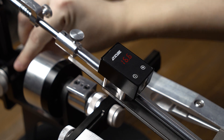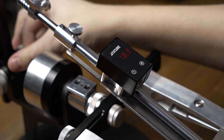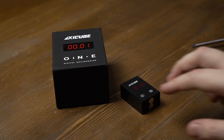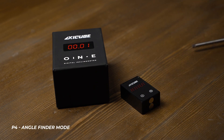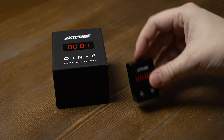After that, we put the angle finder on the stone holder, set the sharpening angle, and fix the lifting unit. Then let's switch to the angle finder operational mode — this is the fourth mode. As you can see, if we zero it in a horizontal position, the vertical lines appear, which means incorrect measurement.